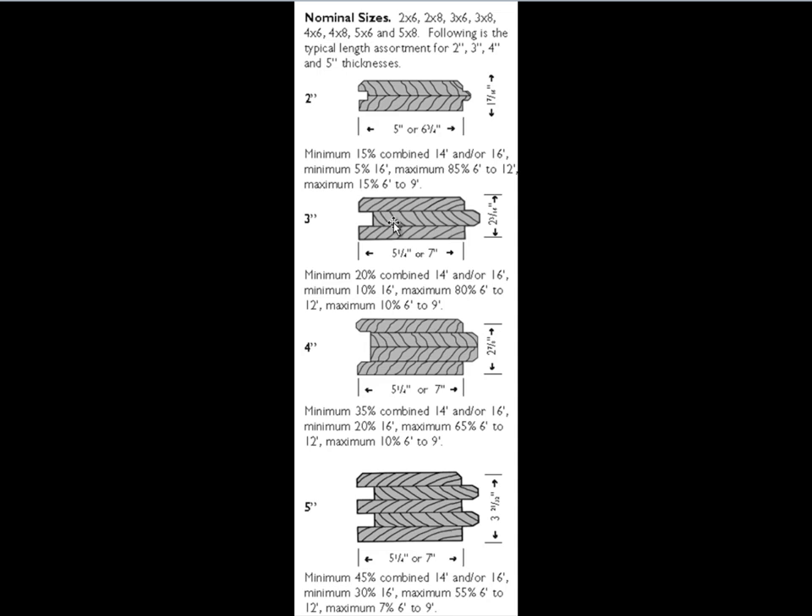We have standard three-quarter inch floorboards that are tongue and groove. Normally those boards are no longer regarded as structural — they are finished boards that rest on top of some kind of subflooring like plywood. This laminated decking is typically used in conjunction with glulam and it's considered visual grade material, so we normally don't cover it over with sheetrock or other finishing materials.